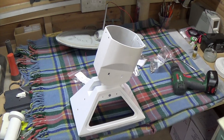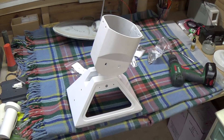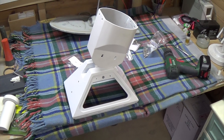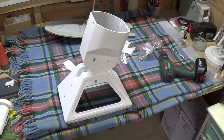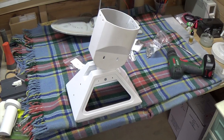Hey guys, just doing a little work on R2. If you saw any of the videos where I was taking these first steps, you'll see there's a few issues I've got to work out. One is the drive shafts and the sprockets keep coming loose no matter how tight I do up the grub screws, and threadlock them as well, so I've got to think of a fix for that.